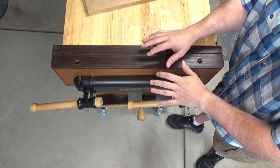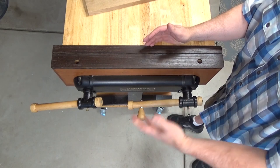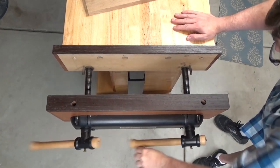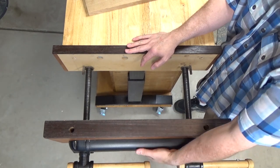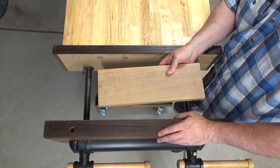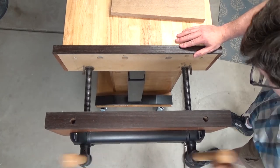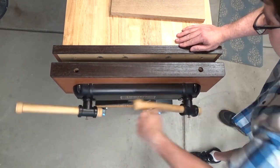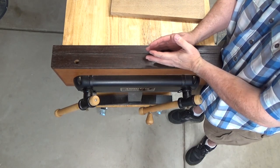One criticism of the Veritas twin screw is the lack of a quick release mechanism, which means to fully open the jaw you have to manually crank it — and the same to close it. With the jaw fully open it has a little bit of a bounce, partly due to the material used for the front face. Truthfully I probably won't use the vise at this extension myself, but it may bother other people. I'm counting about 50 rotations to get the jaw to open and another approximately 50 to get it to close. Honestly that doesn't really bother me, but I could see where it might bother some people.